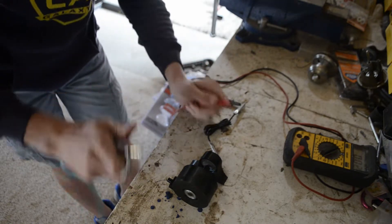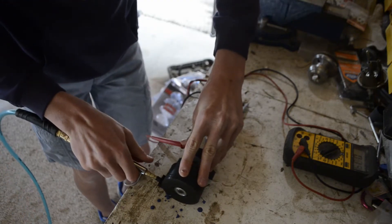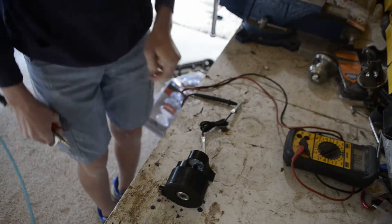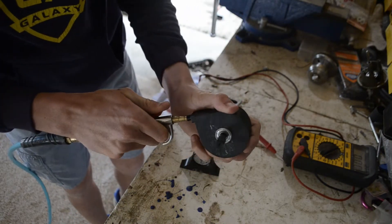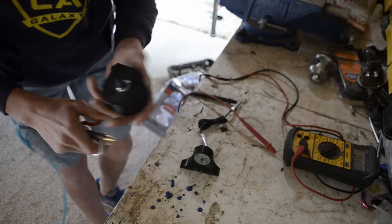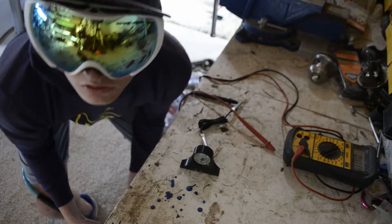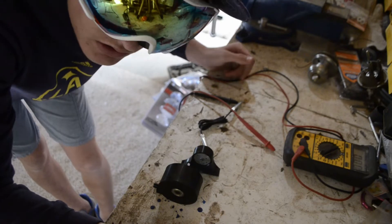The highest I read was 1.7 volts, and the problem is just finding the sweet spot in the coupler. I only read 1.5 that time. For comparison, if I just disconnect the motor real quick, this is how high the thing revs. That motor is not liking to spin up very high. But we did get 2 volts out of it, which is pretty cool. So this is not a very good generator — 2 volts isn't a lot and it can't even power a small LED.